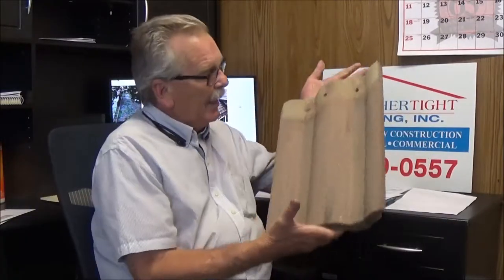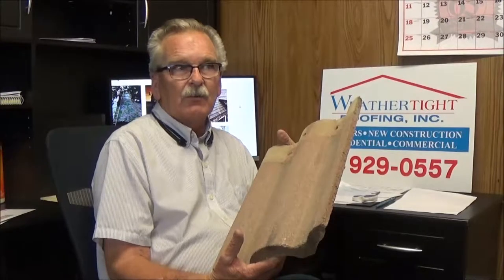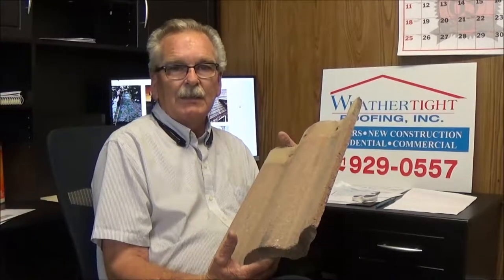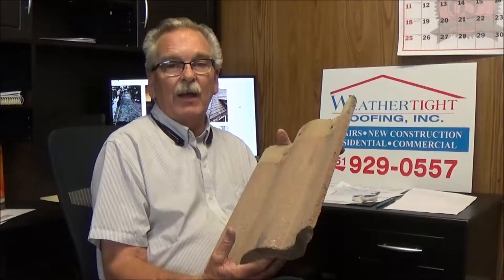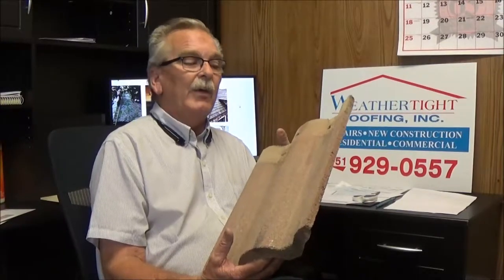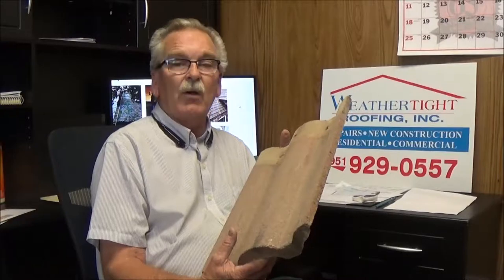On the other hand, we have tile, and this is our concrete tile, and it's about 900 pounds per square, 9 pounds per square foot, so 900 pounds per 100 square feet. An average house is 36 squares, so at 900 pounds, you're sitting up there with close to 30,000 pounds sitting over your head. And this is why if you have a fire in the house, the firemen aren't going inside. They're going to break a window and stand outside and try to put the fire out. Because if you start having major joists get burned, this thing's coming down inside very quickly. Each one's about 10 pounds and it'll do some damage.